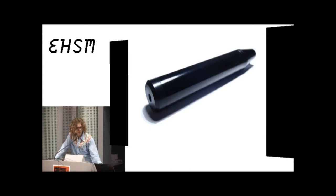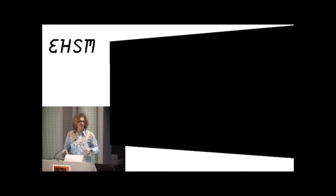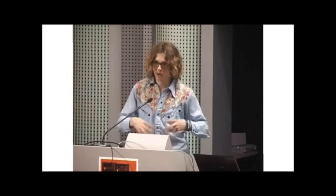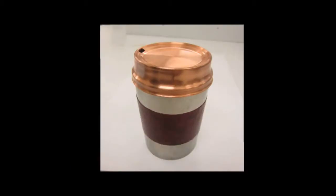With a bit of adaptation a lathe can also be used as a milling machine. Here's a little gearbox I made for a project — I changed the lathe so the cutting tool is now in the chuck where the work used to be, and the work is held on a vertical slide I bolted on. Now I have three axes and can cut slots and all kinds of stuff. Another thing you can do with the lathe: I wanted to make a Starbucks coffee cup out of copper.